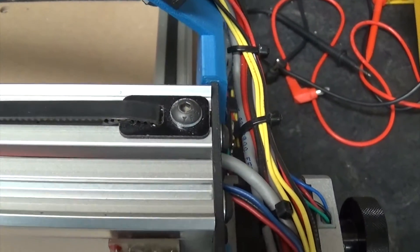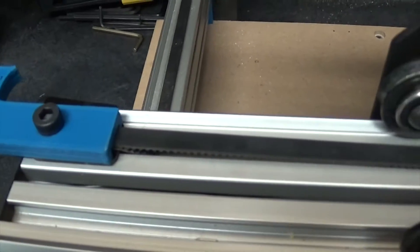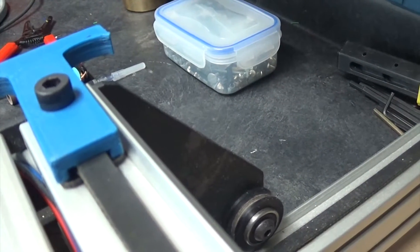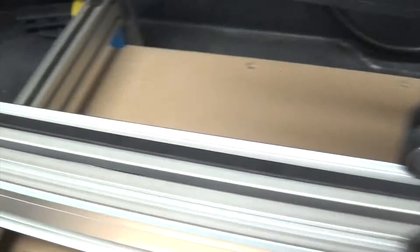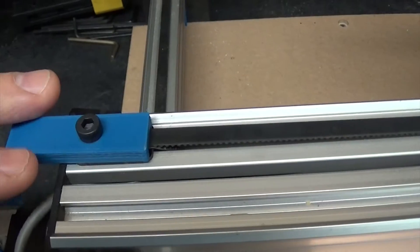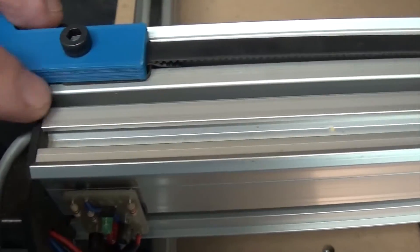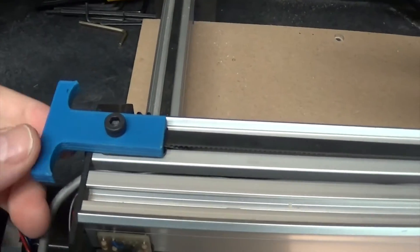I like these kinds of things, especially when they are critical adjustments, to be easy. So I came up with a different way to do this. What I did was I came up with a handle, and the way this handle works is that it fits on top of the clip. You will see that there is a section in the handle that is cut out for the belt to ride up on top of the clip. We are still using the same clip; however, the handle is on top of it and screwed through it. I put my Allen key in here — it doesn't have to be an Allen key, but I like those. What I do is loosen this, get everything positioned, and then I just grab onto the handle to pull it tight. And it makes it a little easier. Once I have gotten the tightness that I want, I just tighten it down. I can get the tightness just where I want it. It is just a little easier to do and I am not muscling everything to get it where I want. Simple enough to do.